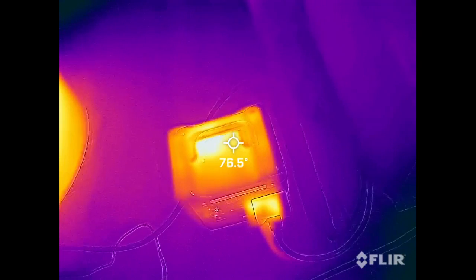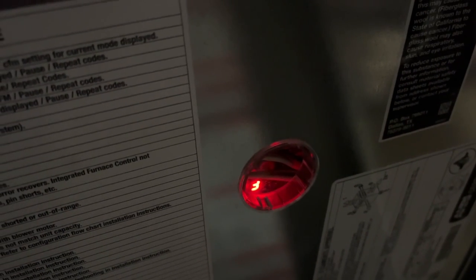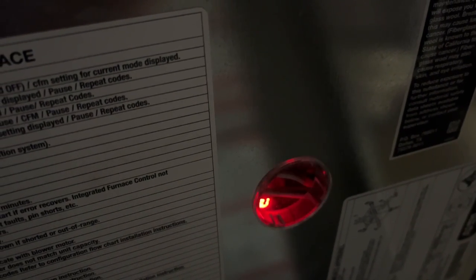The hottest spot is this area in the middle at around 80 degrees. The fans haven't kicked on, but it really hasn't gotten hot enough to need that — it was running at about 70 to 80 watts. If we look at the status display on the furnace it says H35 A400. This is a variable capacity furnace: H35 means it's running at 35 percent capacity and A400 means the blower is running at 400 cubic feet per minute — the lowest setting.